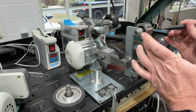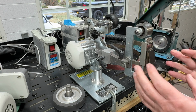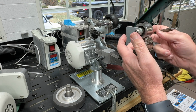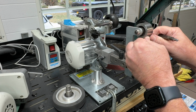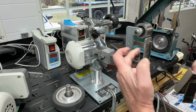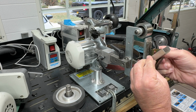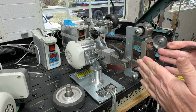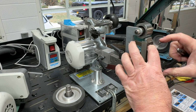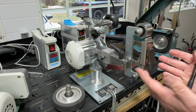There are some that have come with platens that were not magnetic. On my website, in the product section, in the 1x30 area, I have some links to square magnets that are really powerful that people have taken and put on the back side of this platen. They'll put one here and one here, two square ones, 1-inch ones, and that has worked for them and made their platen stick to it on a platen that wasn't magnetic. If it's a magnetic, you can use just the little strip magnets that you see here that I have linked on my page, and that's another way to attach it.